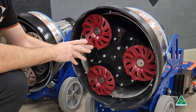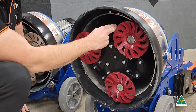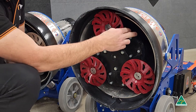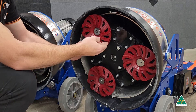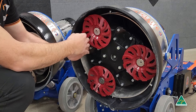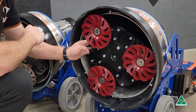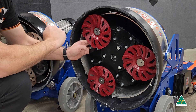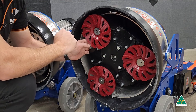Let's have a look at how it works. We have a main tooling disc underneath the machine that spins around at about 380 rpm, and then we have three satellite discs. These are free to move in whichever direction they choose, which keeps the wear on the disc very even. This system is able to produce a very flat floor. That's the Satellite 480 passive planetary system.